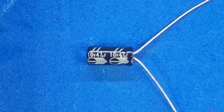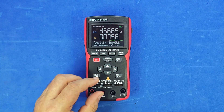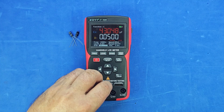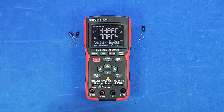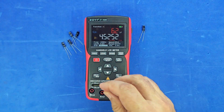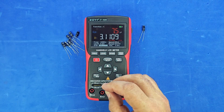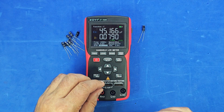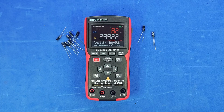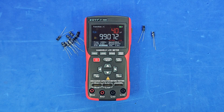Let's take a look at these 47 microfarad electrolytic capacitors and see which ones fall within 5% of the nominal value. This one does. So does this. This one doesn't. That makes seven good ones. Let's pick one more to make it a total of 10 — this one's good too. So we can say that about 80% of these capacitors are within 5% accuracy.